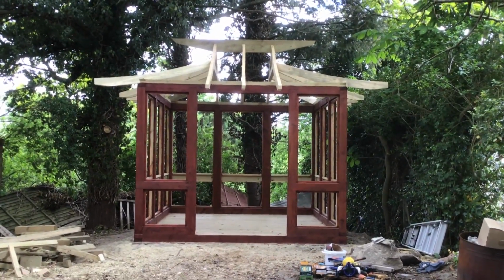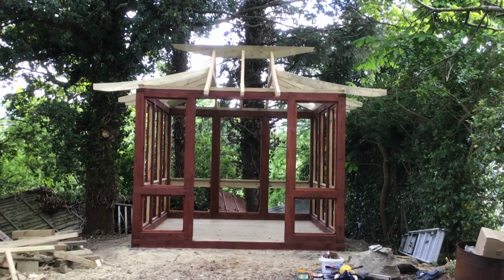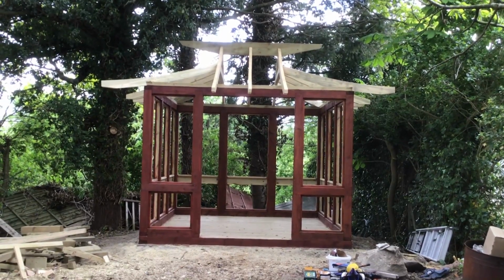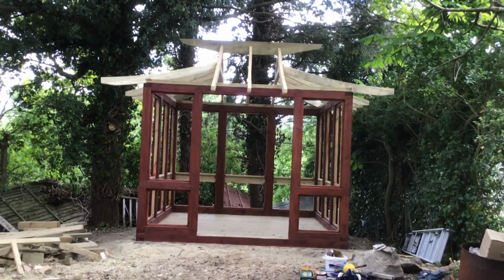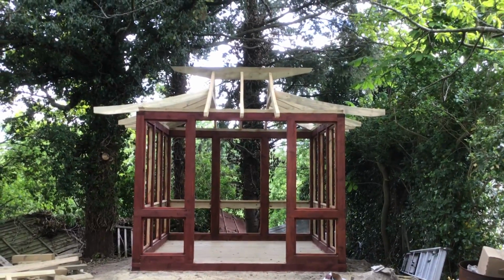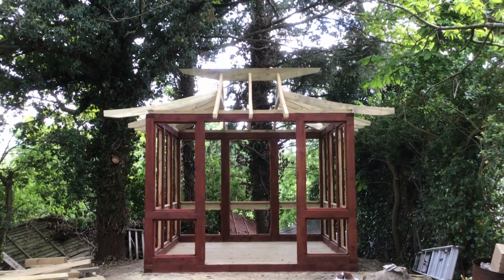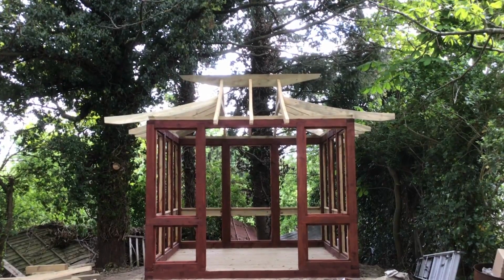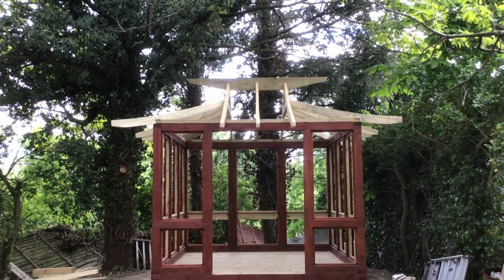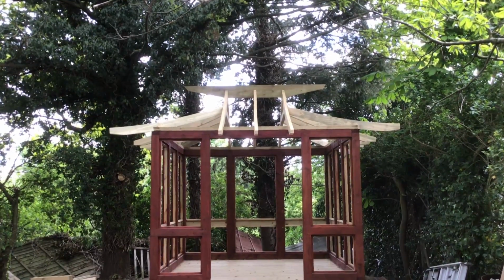And the next stage, I have decided I am going to put them in full. I'll call them the quadrant rafters that fit either side of the corner main rafters. I can't have them 44mm apart, but it doesn't matter. If I do it all equally, it will look symmetrical anyway. So I've decided to go ahead, and I've worked out a way of doing it. But basically, the main frame of the roof is now in place. The other ones, to be quite frank, are just to make the roof frame look quite nice from inside, and two on the outside where the drainage system will be fitted.